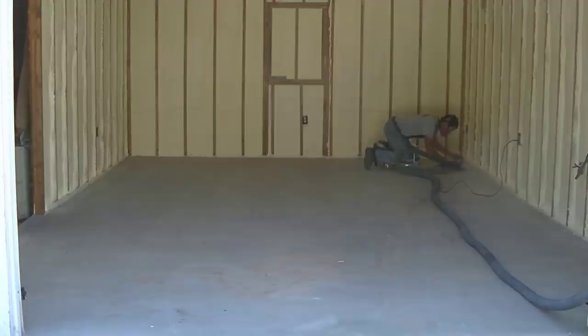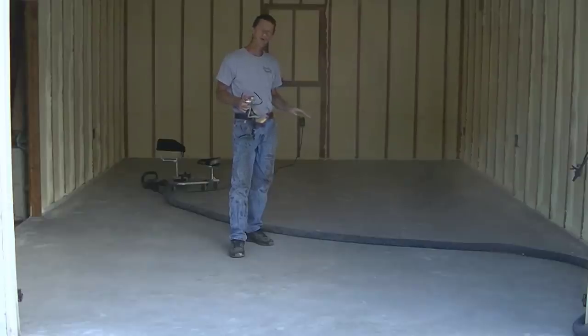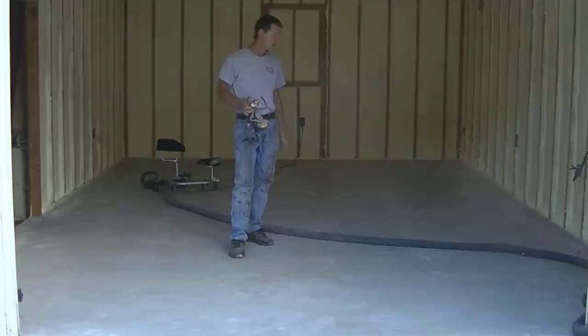I'm going to tell you what it is, so make sure you hang out. I'm going to show you at the end of the video a couple different types of concrete paints you can use and get online for your own garage floor. But the first thing we got to do is prep the floor. If your garage floor already has some type of coating, sealer, or concrete paint that you previously put on, we've got to grind that stuff off.